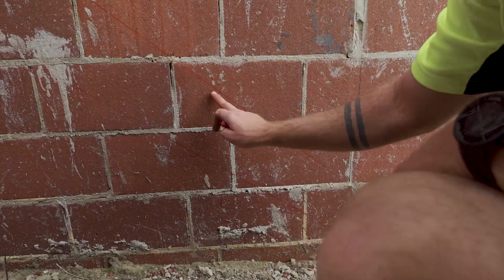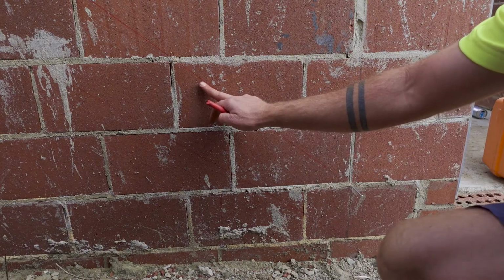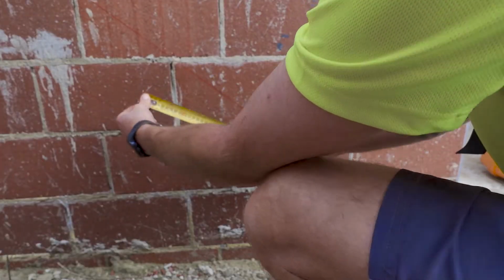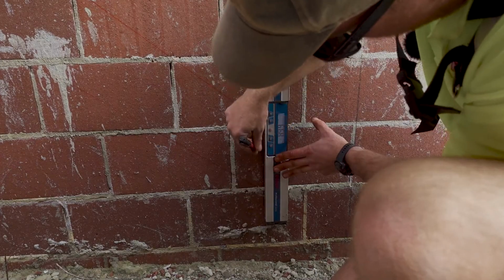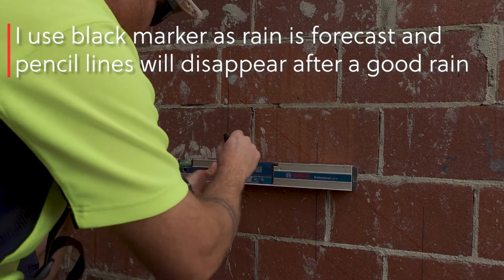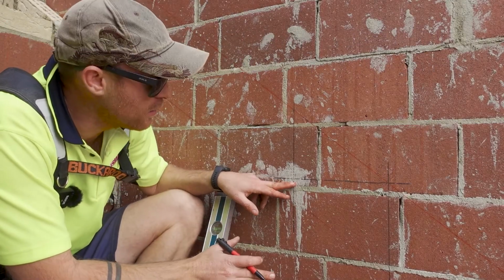But down here, I've got my chalk line, which is representing the top of each step. With what I just worked out from the triangle, I'm gonna mark out the divisions. 303.35. And then we can plumb down these points. So now I'm going to show you the first shortcut of using a digital level.